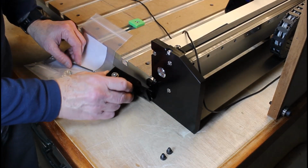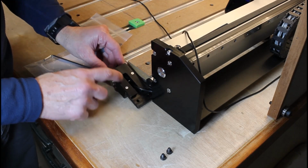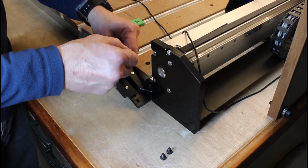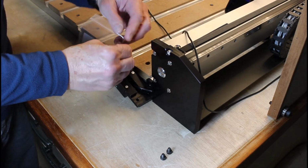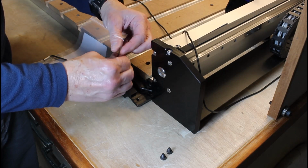Once you remove the Bitsetter from the frame, the next step of the operation is to remove these three small screws located here. Use the smaller Allen wrench. The three screws hold the mounting plate of the Bitsetter housing. It also protects the button and the proximity sensor inside.